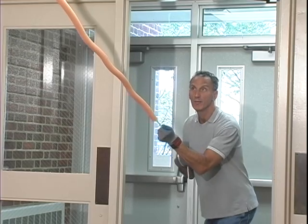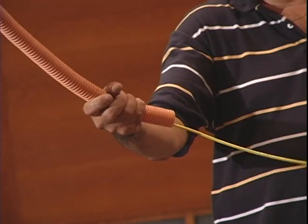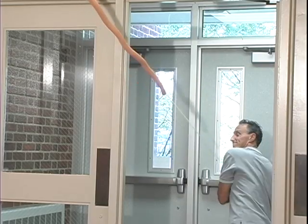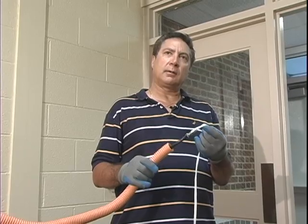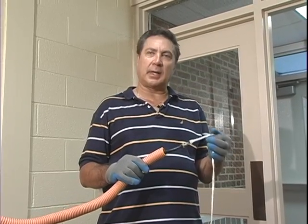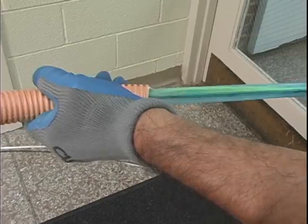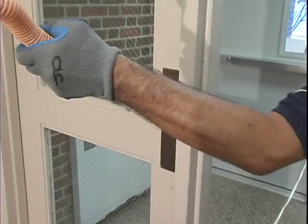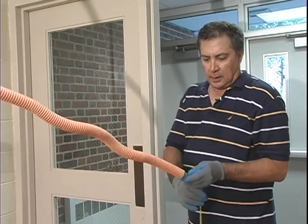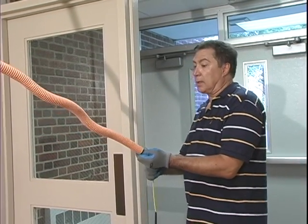Phil, pull! Antonio, pull! Phil and I just changed places. The head of the fiber is now coming out, so we have to be just a little bit careful right now as we're getting the head out. I'm going to pull it straight until the full head of the fiber is out. Now we could pull on the actual fiber cable — it's pretty tough, so we could put a little bit of pressure on it, not a lot, but a little bit.